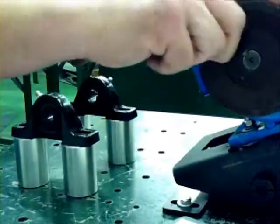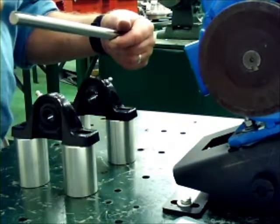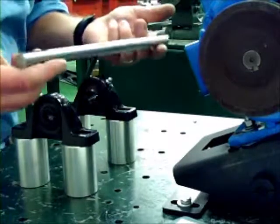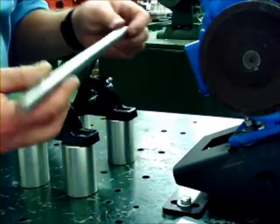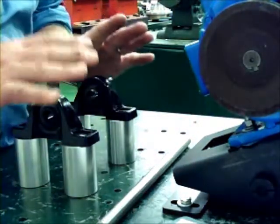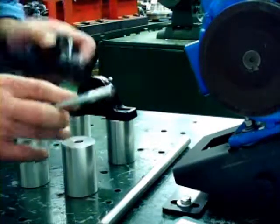Now, also, you should make a note here. This is a 3.6-inch sheave. It should be a 2-inch sheave for lab 4 of drive systems, but any sheave mounting is exactly the same way. We'll leave it the way it is. And again, 8-inch shaft rather than the 12-inch shaft that I have here, but definitely use the 5/8 diameter and not the 1-inch diameter. And so the pillow block bearings are all going to be exactly the same as you had in lab 3.